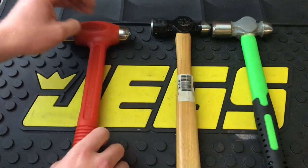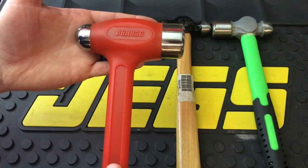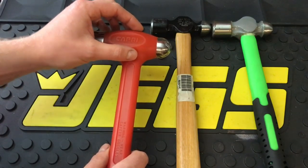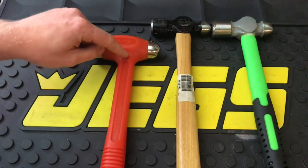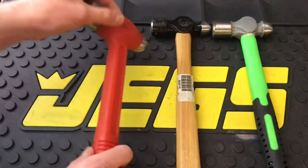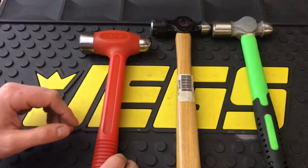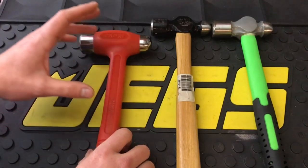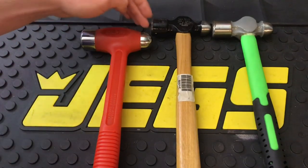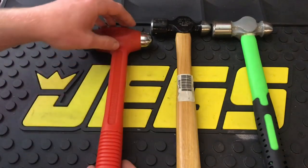Whereas the dead blow ball peen — this one being from Capri, part number DBHB-36, a 36-ounce ball peen — they've incorporated the dead blow portion into here, which is steel shot inside. It has a metal rod all the way down through the handle that is welded up at the top. So with this dead blow action, when you strike something you don't feel the recoil like you would with a wood or fiberglass handle — the recoil is extremely reduced. It feels great in the hand, and besides the metal rod welded here, you have a nice polished steel ball peen and flathead, and then a poly mold handle — all one piece at the head.